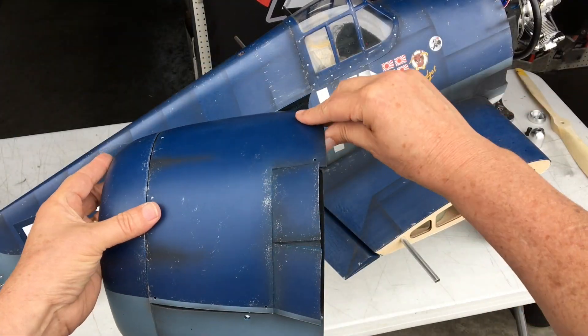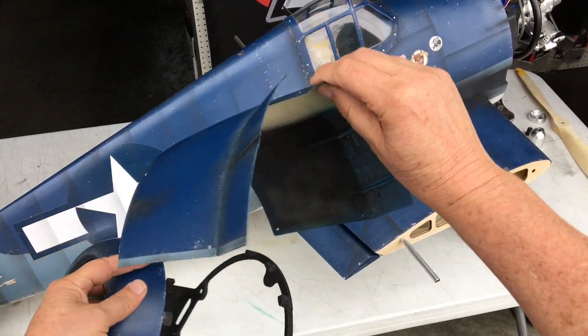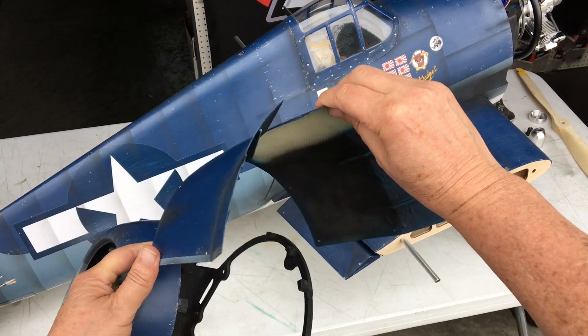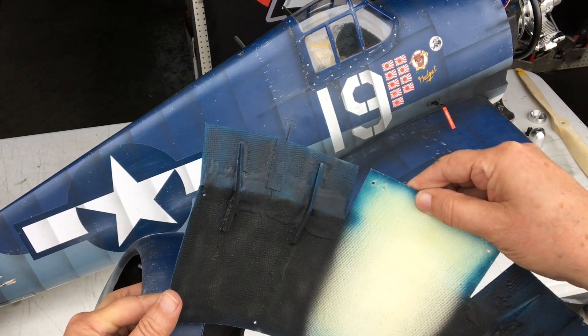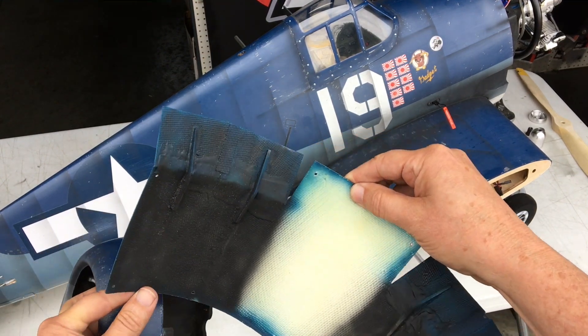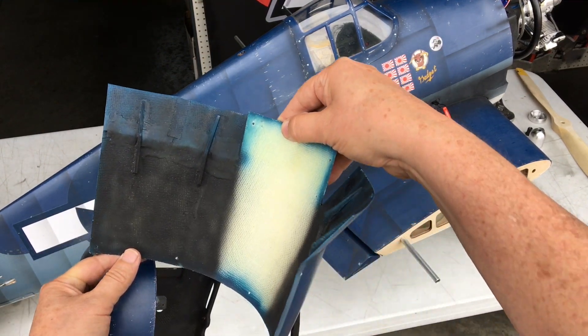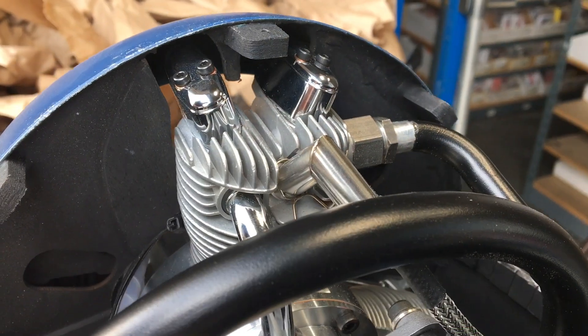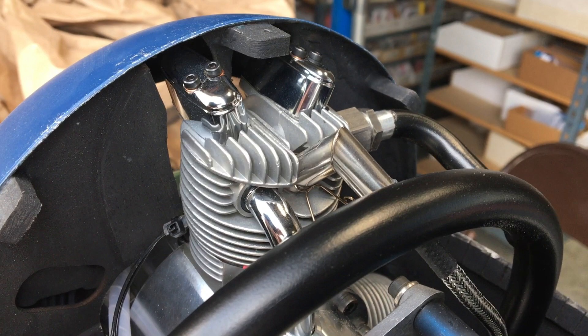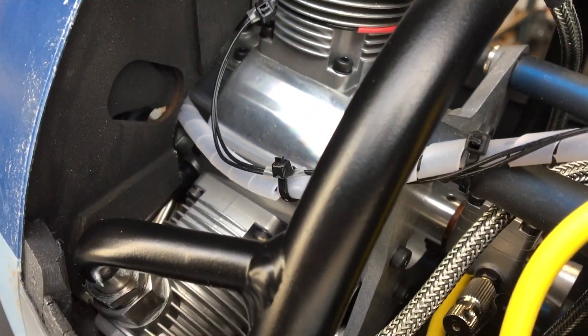This wasn't required, but I did cut out the top half of the cowling for an access and inspection plate. You can also see here where I used 1/8 inch plywood to cut out angle brackets for the cowl flaps I opened up, and the fiberglass I used to reinforce it. The front cowling frame plate was cut and modified to direct all the air through the cooling fins of the engine.